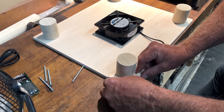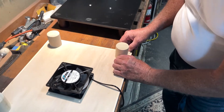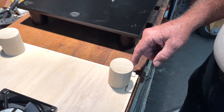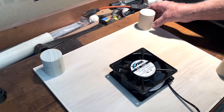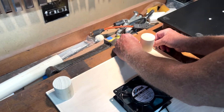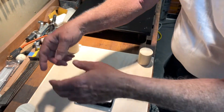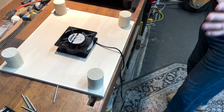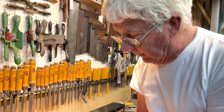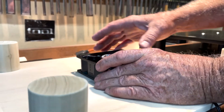It doesn't take any screws, just a good strong PVA glue. The way I did all the corners of the blocks is I moved this around to give me a spacing distance between the front and the side, since you're in the corner. I did that on all of them — put the board down, use the little gap spacers, do each one, and you're done. Then it's just centering and drilling your four bolt holes.